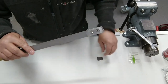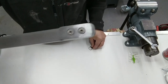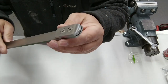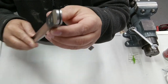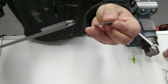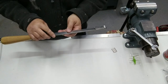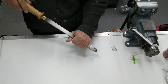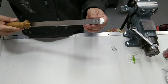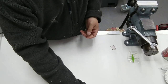Just before I put that down, I'll show you that the carbide insert fits in by means of two M5 countersunk screws - that's the clamp arrangement. You can just about see it clamps down onto the carbide, which fits in here like this. So if I find this is too long for me when I'm using it, I can always shorten it and reconstitute the clamping arrangement on the end if I need to. So I can modify this if it's necessary.